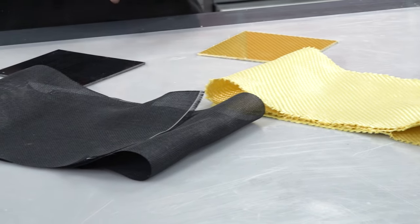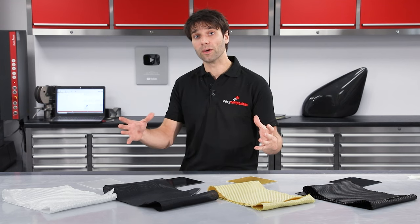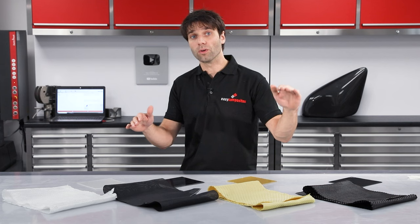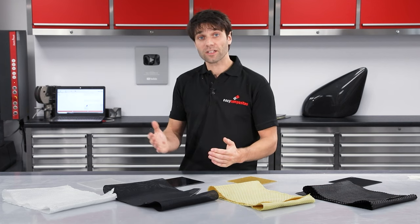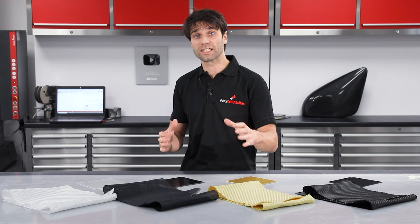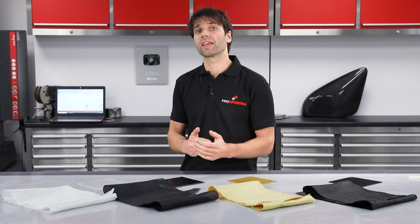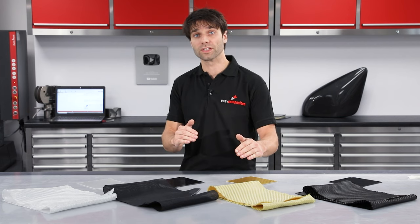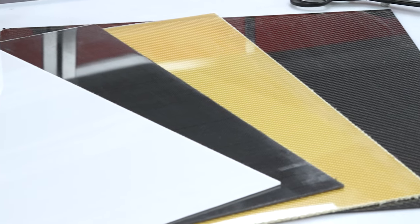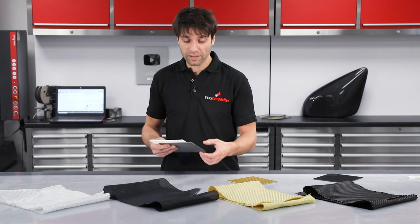There are three main characteristics that we're interested in: stiffness, strength, and failure mode. Stiffness is important because we need these sledges to carry their payload whilst being hauled without sagging or contacting the snow and without excessively warping. Strength matters because these sledges will likely encounter frequent impacts during the expedition. The failure mode addresses what happens if the strength is exceeded — if the laminate fractures, does it leave the sledge still serviceable? I've made up samples of the most likely materials, all infused at the same time with IN2 infusion resin, with plies selected to give approximately the same 2mm thickness.